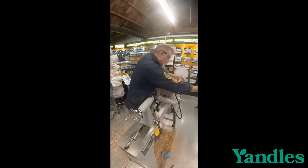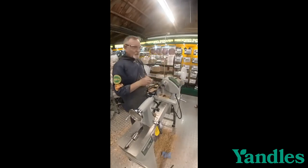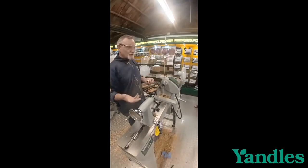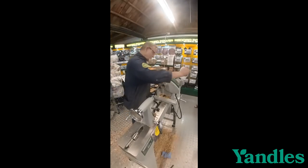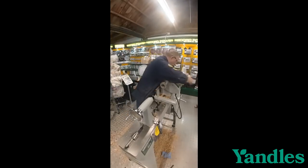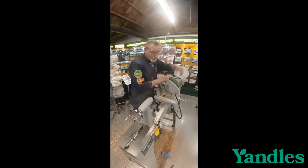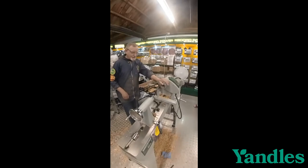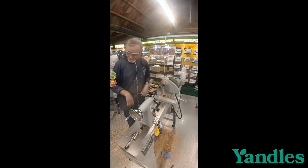There's your threaded live centre, 3/4 16. Western-super-Mare's got two nuts and bolt shops. One's actually called Nuts and Bolts, the other one's called Tools and Fixings. You've got them all over the place. Most engineering type towns have got something like this, so you can go and buy the bit you need quite readily. That's a 1-inch Forstner bit hole, chiseled out to make it hexagonal. Push the nut in, couple of drips of super glue, you're away.